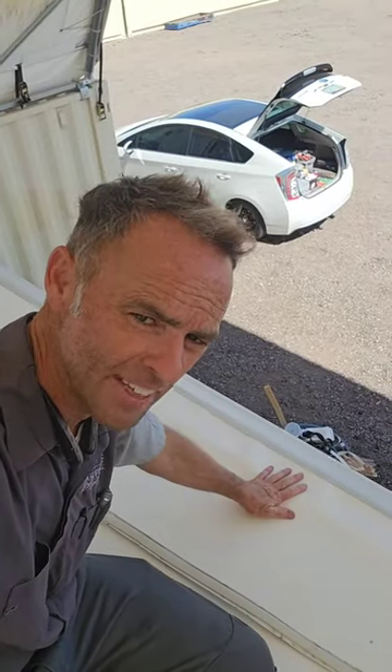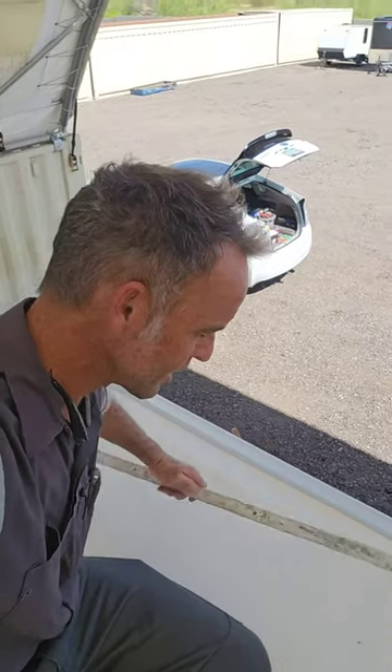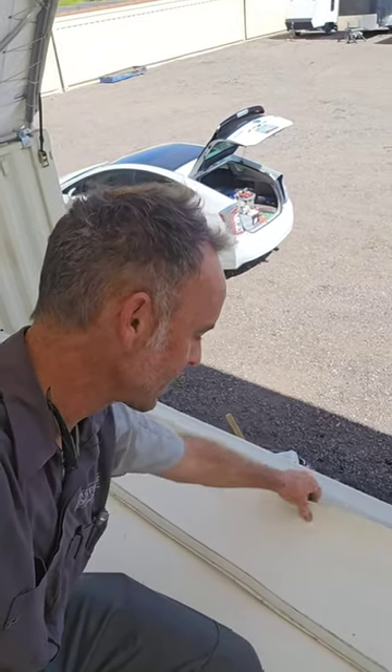That's why I like to put the membrane on top of the wall, acting like a shingle or flashing, so that if the screws ever let go and water tries to get underneath that molding, it's just going to go on top of the membrane and then on top of the wall and still go out — it never goes inside the wall.